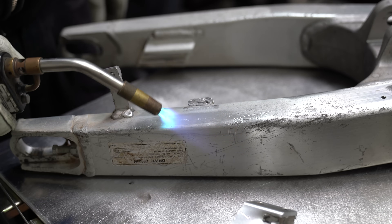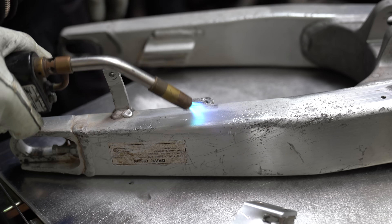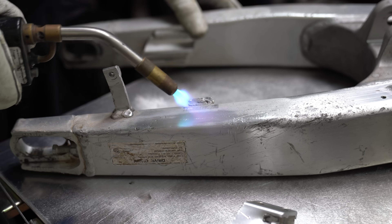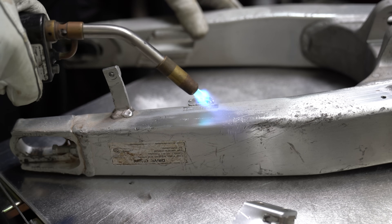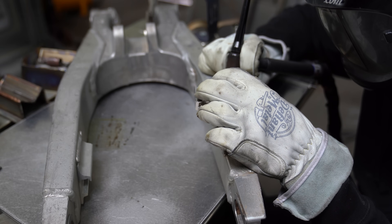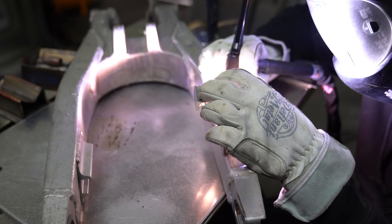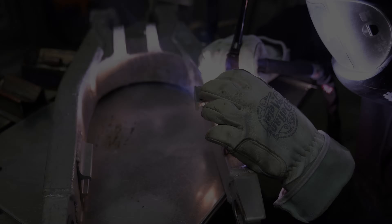I'm not going to bore you with a whole bunch of this, but preheat is going to do two things here. One, it's going to get any kind of impurities or junk off of the surface. And two, it's going to make it easier to weld that tab on because that base swing arm is thicker and there's more surface area than there is on the tab. That should help your weld pool develop just a little bit quicker and a lot easier. Into the weld shop we go.